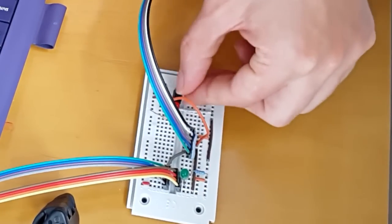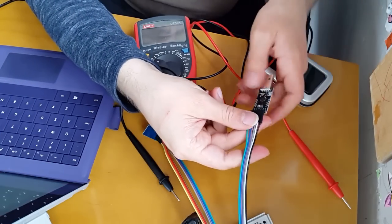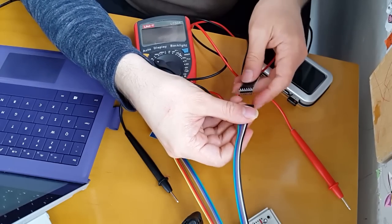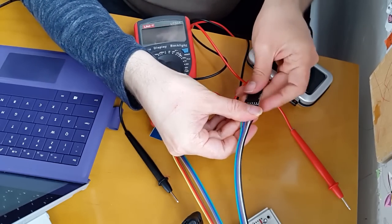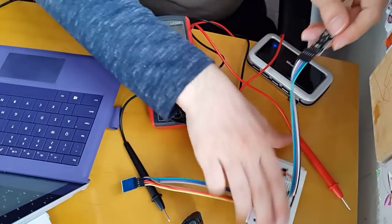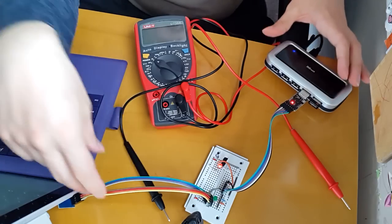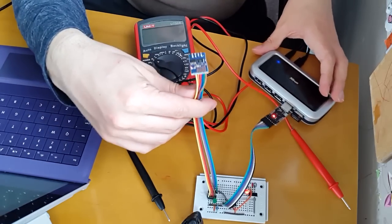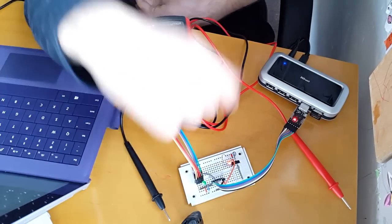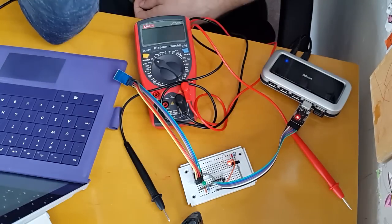No power and no LED flashing — we've got a problem. I've connected that backwards, which is exactly what I wanted to avoid. After saying I'd connect ground on the black pin, I made it on another pin. I might have actually damaged something here, but hopefully nothing major. Flashing light means it's all still okay. It's an easy mistake to make — there's no real polarity on the connector, so you do have to watch the colours of these leads.